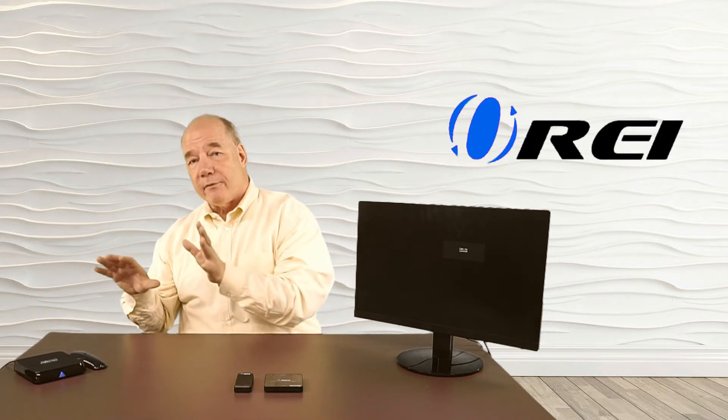Now I'll show you just how easy it is to use the WHD Pro 100K with your own equipment at home. Let's pretend you have a media device — it could be a DVD player, game console, or cable box — and you want to display that content on a monitor up to 30 meters away. On the table I have the receiver module and the transmitter module. I've run a short HDMI cable off the back of this monitor and connected it to the HDMI output port on the module, and I've also plugged in the power supply to the micro USB port.